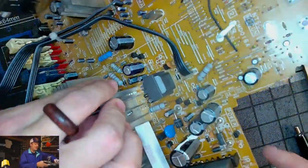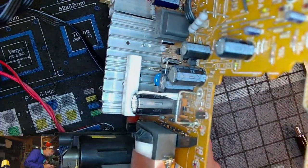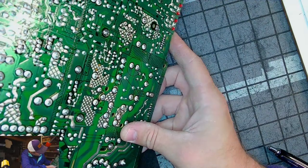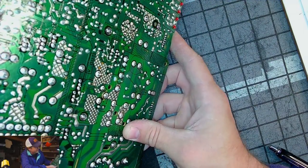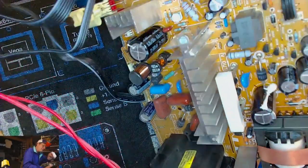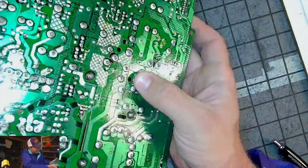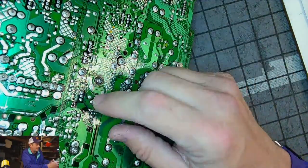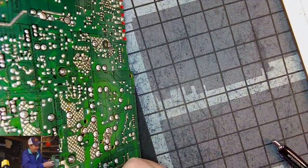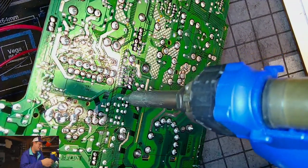And when that happens, that's generally when I go in and I just go ahead and remove the capacitor. One thing I did notice about this Toshiba board is things are not marked clearly. There's lots on this backside that are not marked. It's not like you can tell exactly what you're desoldering easy. And that's not a good thing. So this is right below. See, there's like a cluster of components down here, but there's no markings as to what they are. So I gotta make sure I grab the right one. It's over, there's a break, and then this is it. So that looks like a capacitor. We'll remove that, because that one's definitely coming no matter what, whether it's reading good or bad.